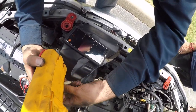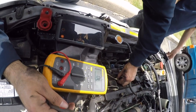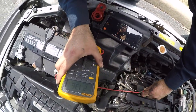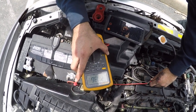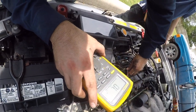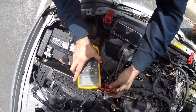He took it somewhere before and they told him it was bad. The suspicion is that 212-213 kilohms between the outside and the middle is normal. The K in front of ohms means times 1,000, so that's 213,000 ohms. Since both good readings are around 212,000-213,000, and the suspected bad coil reads open — not electrically connected — that's likely the bad one.